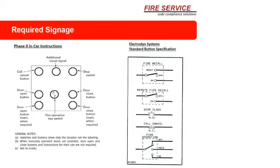Now notice, when we created this system, we did a couple of things to simplify what we're doing. Everything, if you'll notice, is simple, single pole, normally open. Single pole, triple throw switch. Not magical, no overlapping contacts, very simple.